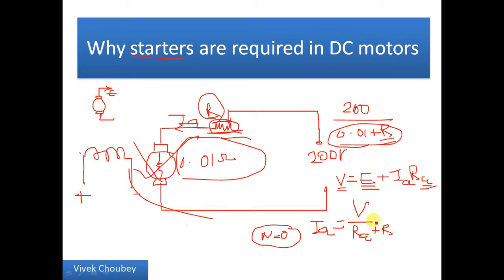That is why we need to add the additional resistance R to RA, which reduces the starting current. Once the motor has started successfully and is rotating at a steady speed, there is a value of speed n, and because of this there is a value of back EMF E which is no longer zero. The armature current equation becomes IA = (V − E) / RA. With the increase of speed, E increases and hence the armature current decreases. So there is no use of keeping the resistance in — it would cause unwanted heat loss — and that is why the starter resistance is cut out.